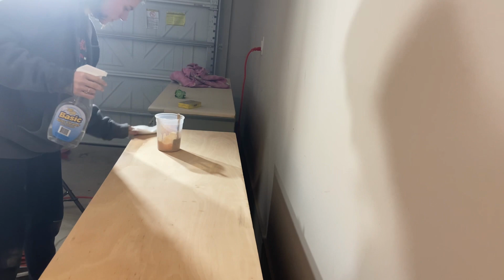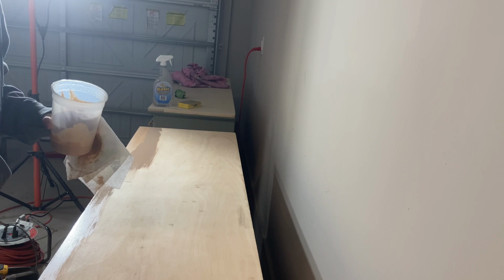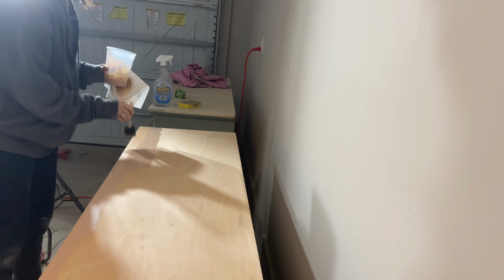And then you'll see me step back and panic because I realized it was too thick and I was starting to hate it. I needed to water it down a little bit more, but there was paint already on the wood, so I got a spray bottle filled with just water and spritzed it down before I laid down more paint. I just wanted the wash to neutralize the wood so when I applied my poly it wouldn't turn orange, so I'm wiping any excess back so it doesn't completely saturate the wood.